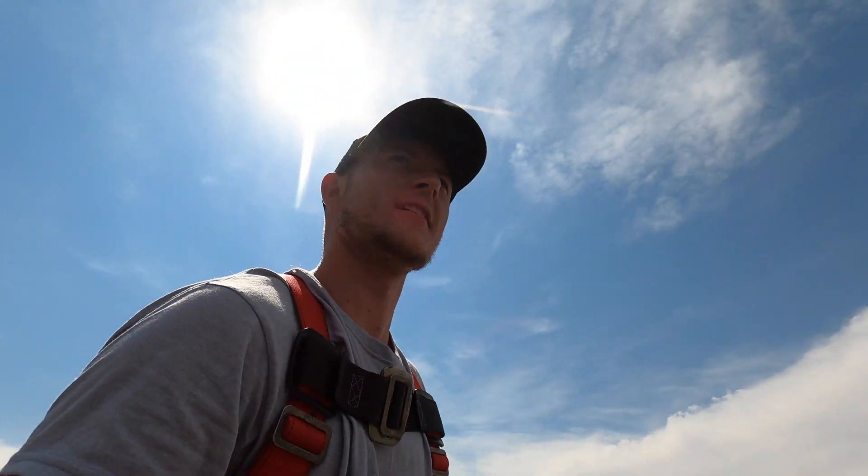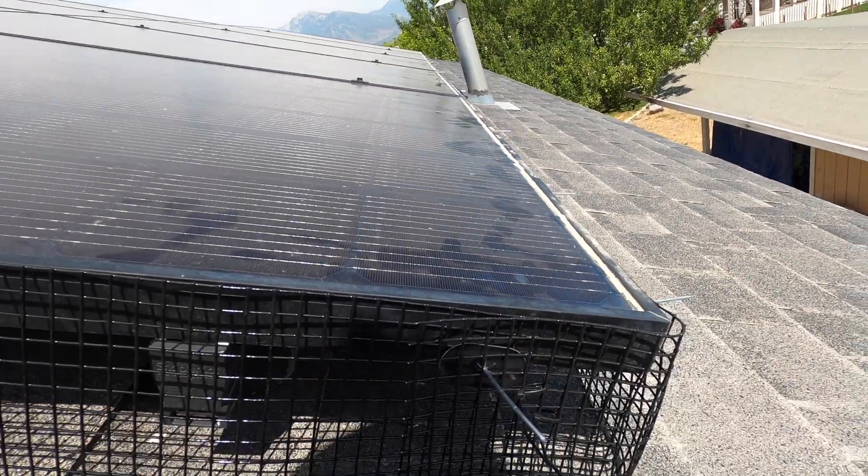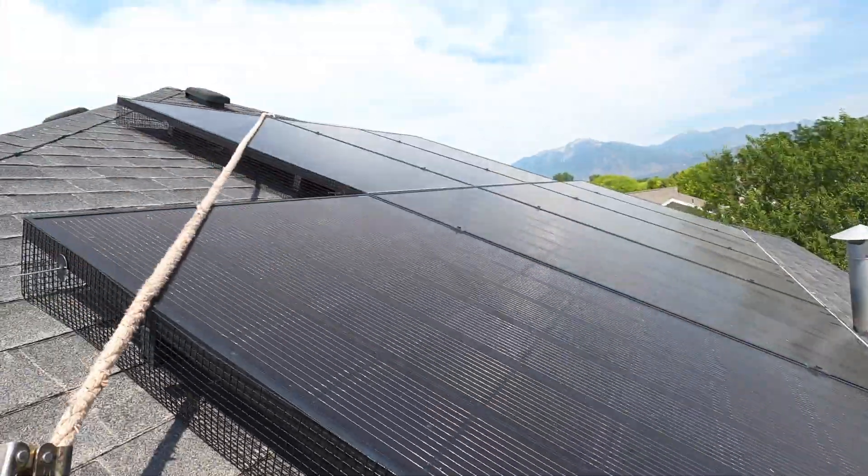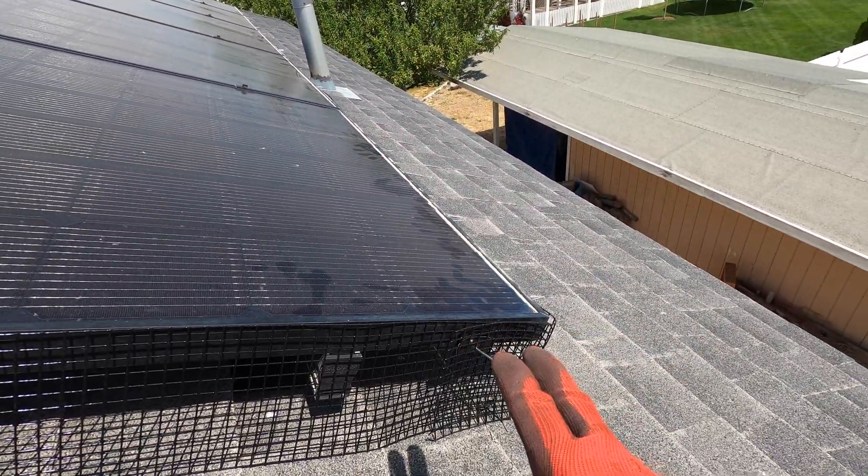Another thing to consider is buying zip ties. Keep in mind that generic Walmart zip ties aren't UV-rated — if they're out in the sun all day they'll get brittle and break, so it's not a great long-term solution. I'll link below the equipment I'm using, including a crimp-on steel zip tie I like, and some UV-rated plastic zip ties. For parts of the array where the screen overlaps, I've used three zip ties and an extra clip. I seriously can't believe how easy that installation was.